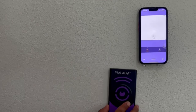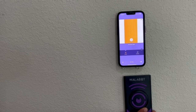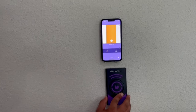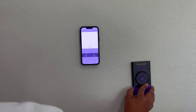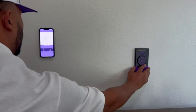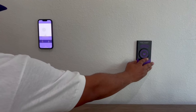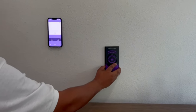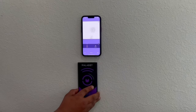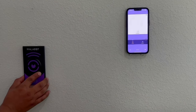Let's see if we can find another one — and there's another stud right here. It's really nice; we actually have a battery indicator that tells us exactly how much juice is left in our battery. We have another wood stud right there, and it tells us nearby objects have been detected. We do have a bathroom on the other side of this wall, so we want to scan very well to make sure we have no pipes in the way when we start drilling.